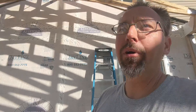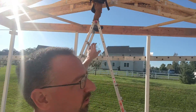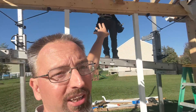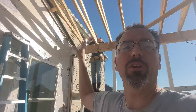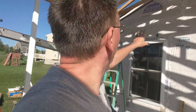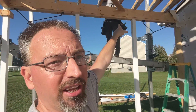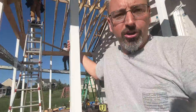This will get us overnight for now and we can come back tomorrow and keep going with the next steps. You can really see the screen room starting to come together. We're going to have beautiful screening up in the gable archway in this vaulted ceiling. German and Steve are working on putting in the joist hangers and hurricane straps to help hold things together. We've got toenails into things, but those hurricane straps are really going to help hold things down. We're bringing the trusses down into the top of the beams — we've got the beams bolted down. We showed you the all-thread in the last video that runs all the way down through these and into the footers, anchoring this whole system to the ground to help prevent wind uplift should we ever have a tornado or severe weather situation.